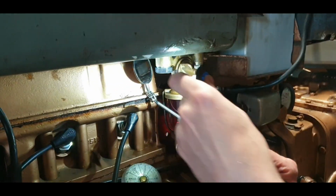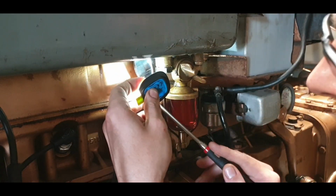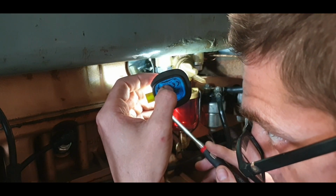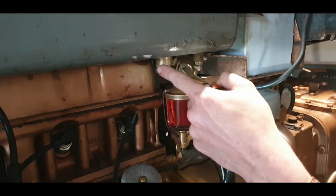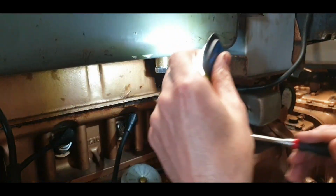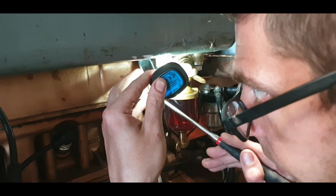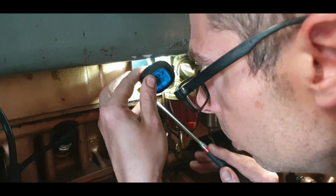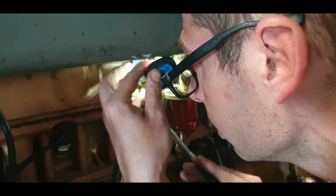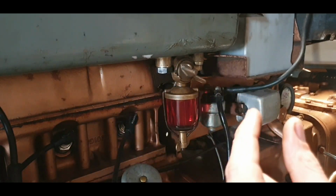so far. Basically it's just going to be a matter of flattening the bottom of that tank slowly. I think that's what's going to take to get this sealed, flattening it slowly, and then our sealing washer should eventually seal. Why it decided to leak all of a sudden? Well, I have an idea already how it has. These were never tight enough, vibrations, we'll say, going down the road, at certain revs, got it to shimmy a little bit, moved the washer, and that was all it took, and I could never get it back in the right place. I think that's probably what caused it. So far, there's nothing visibly leaking there, I don't think. Usually you see the shiny kind of petrol around. That said, it could be slowly weeping away there. It wouldn't surprise me at all. As I said, it isn't as wide as I would like it to be.